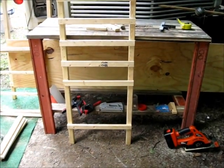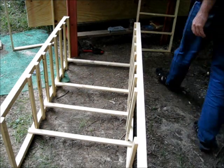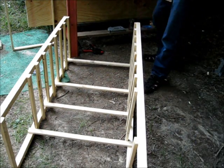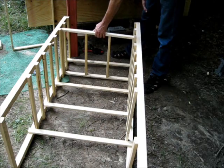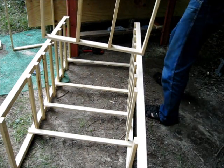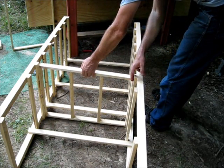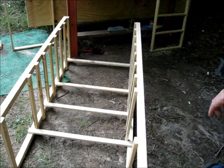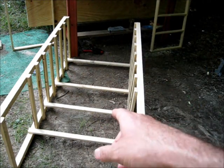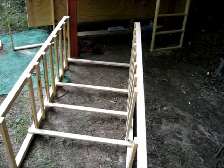There's one side wall done. Piecing together the frame, and I just want to make sure that my shelf will slide in here. It should slide in nicely and fit right between the frames all the way — and it does. I'll try a couple of these slots to make sure it fits. It should sit a little loosely and rest on these lips, and it does. So that's perfect. Now I'm going to continue cutting the boards. I'll cut the other four and nail this frame together, and then I can stand it up and continue on with the construction.